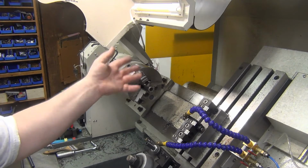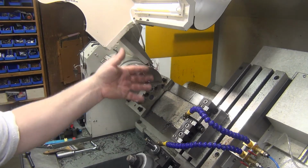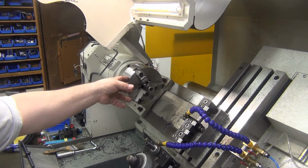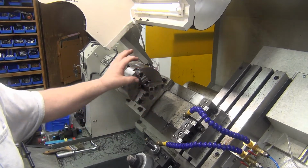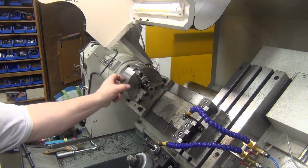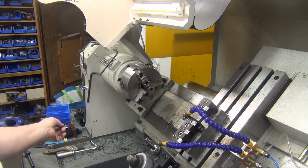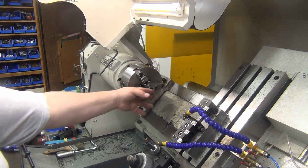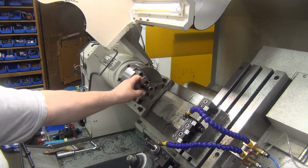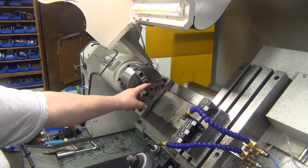Okay, it was already M1'd. Then it goes in and shuts the spindle off and it's still in M1, so then I hit cycle start. It M5s so that I can flip this over and do the other side. And since the dimensions, the length isn't critical at all, I just use that same tool, the same depth stop, to set it. Now there's a big burr on the back side there, and I got to kind of get a little creative with exactly how I set it.